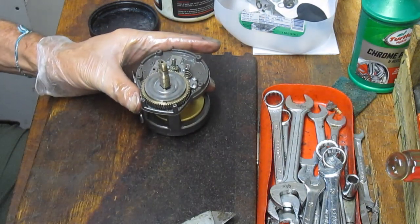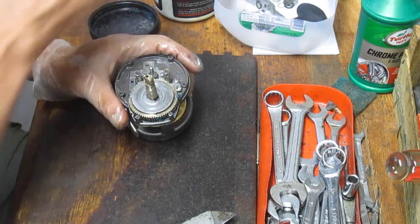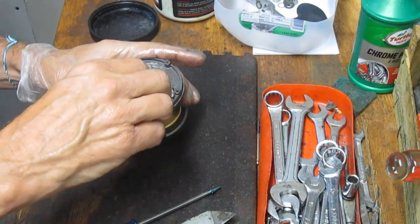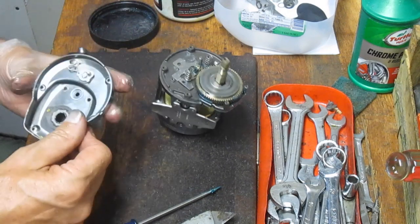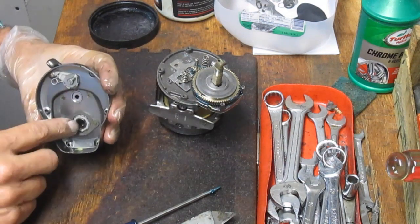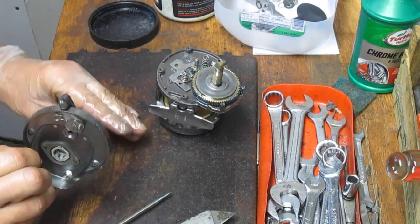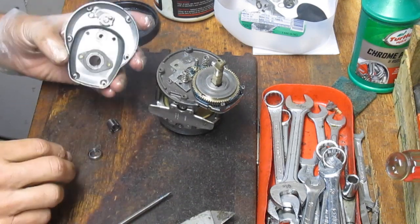We've put a little bit of lube on the top and we're going to put a little bit on a few corners — north, east, south, west — on the main gear. Because the main gear is bigger than the spool gear, as you crank around the grease spreads, so you don't need to get it in all the places. Just do a quick turn to make sure everything's turning, which it is. Then just a drop of oil onto your eccentric gear — make sure it's working. That's all you need there.